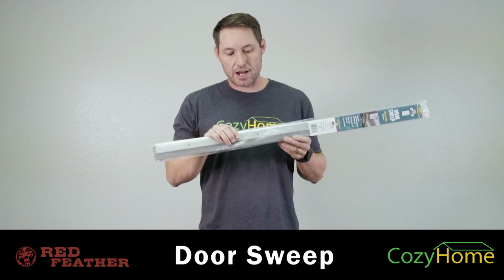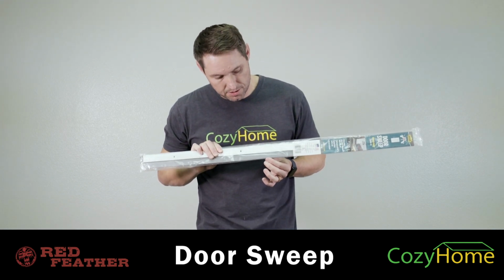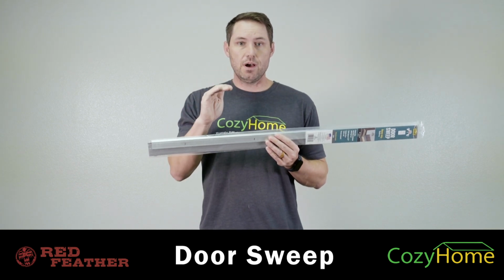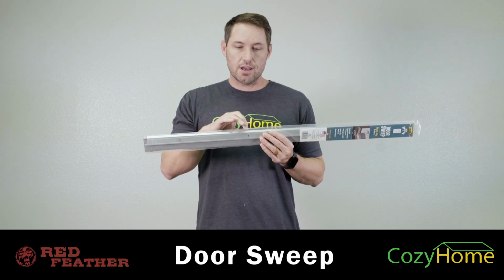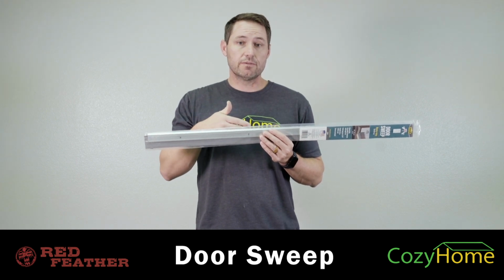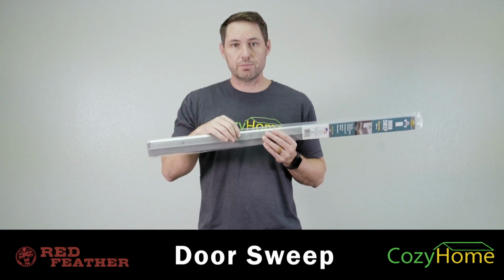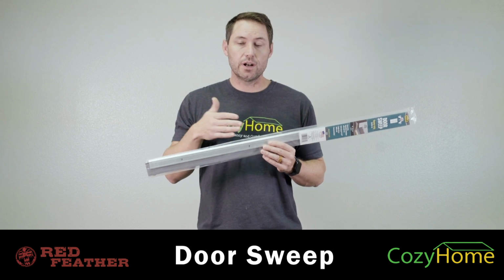And then you just screw it to the bottom of your door, and you want these little rubber flaps here to be touching the threshold, which is that little bump on the floor below your door. If your door doesn't have a threshold, you can run this all the way down to the floor, but what happens then is that as you open and close that door, this will be dragging on your floor, which can make your door kind of hard to open and close.